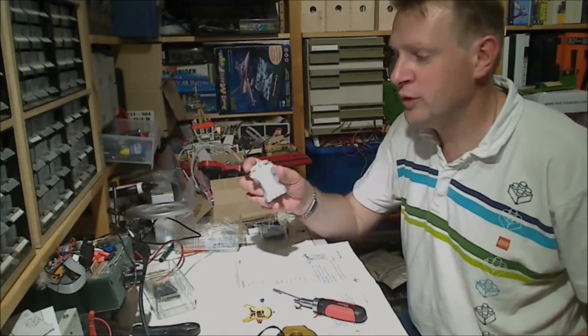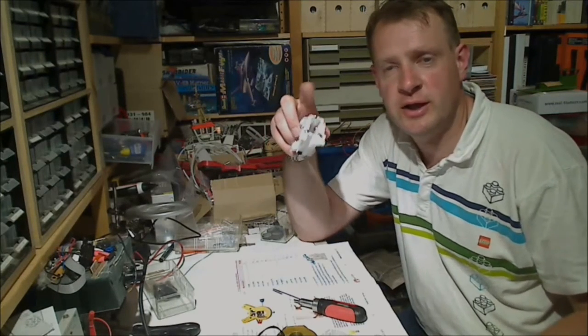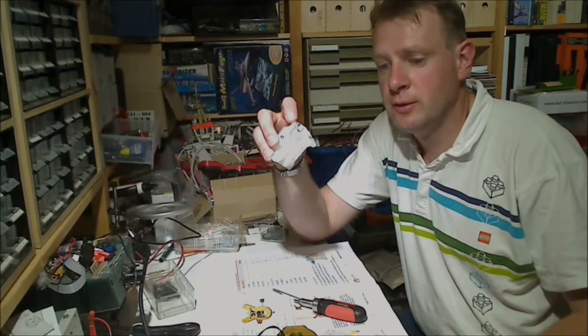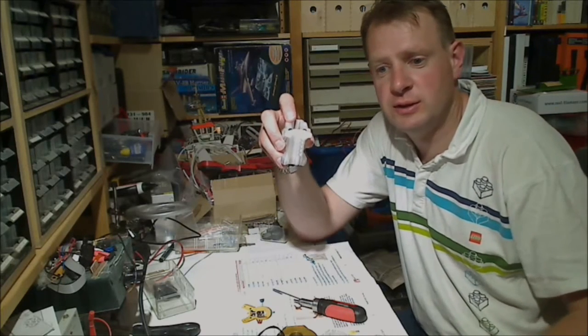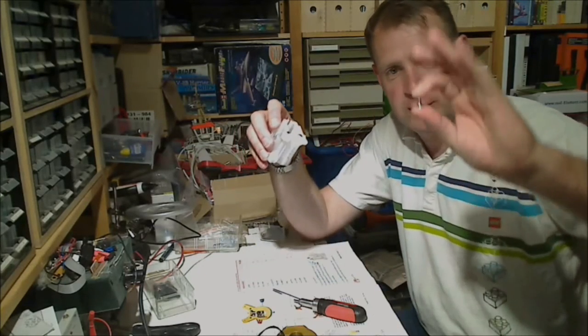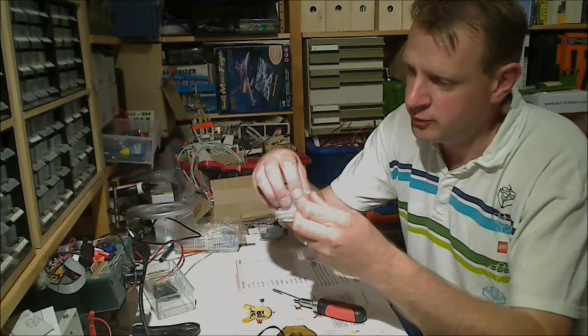So next we are going to put in the screws that will engage with the end stop switches we put on the upper vertex earlier. These screws are for adjusting the endpoints so we can get nice and even bed leveling. So what we do is we take an M4x10 screw and we put it into the hole here.